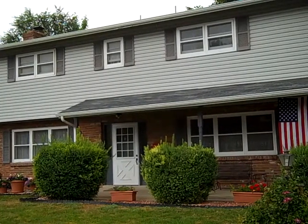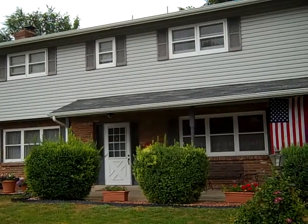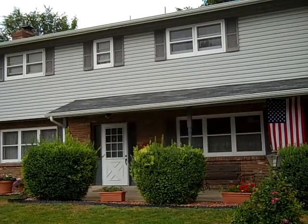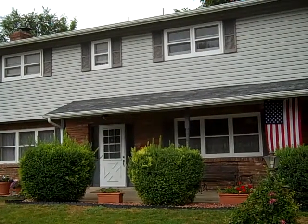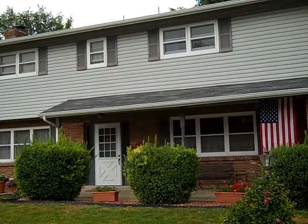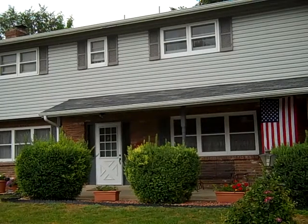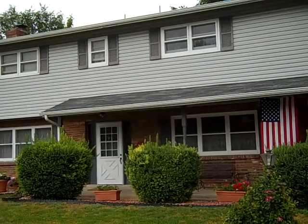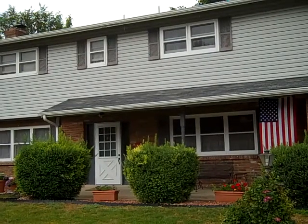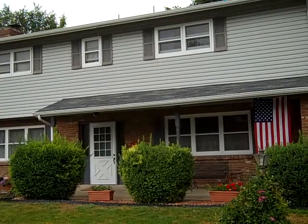Today we're going to tear up that floor and get it all the way down to the joists. Well, at least around the toilet area we're going to go down to the joists. I believe what's happened in this bathroom is someone put particle board down on top of the plywood and then used tile and mesh, and it's a mess. It's leaked all around the toilet and has caused everything to sag, so it's all gotta go. Let's go inside and take a look.